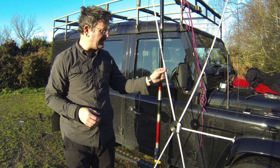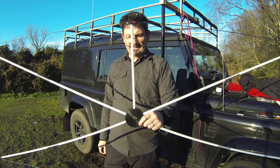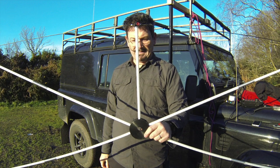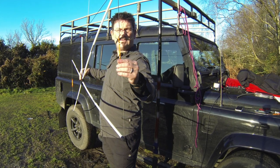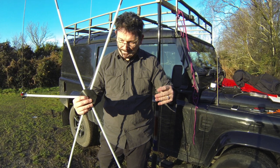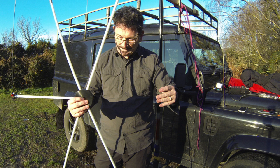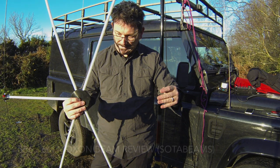To wrap up, the SB6 seems to be a really nicely made little antenna. It's very quick to erect. The universal hub works really nicely and fits on a telescopic pole very well, and it's robust enough that it's not going to suffer undue pressure if it gets a little bit windy and the antenna starts moving around. There are a few delicate parts when constructing it for the first time, so just be a little careful. With regards to performance, clearly it works, but we'll wait and see how we get on in the UK Activity Contests in 2015. That concludes my review of the SotaBeams SB6 6 metre beam.